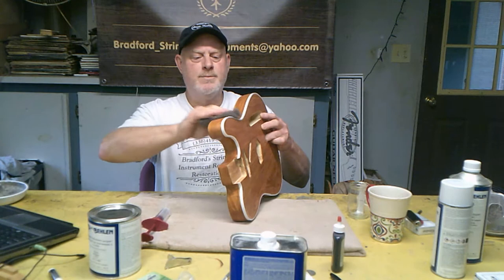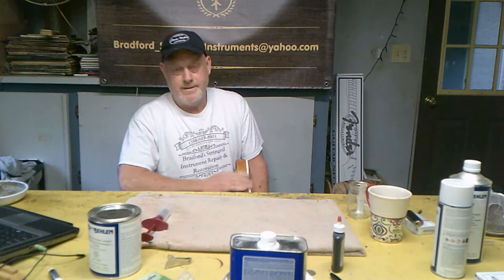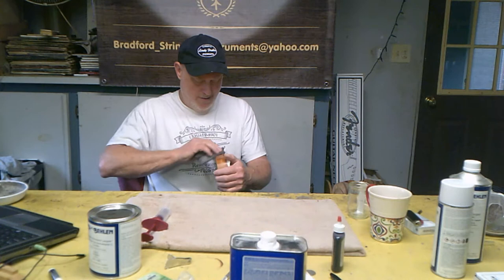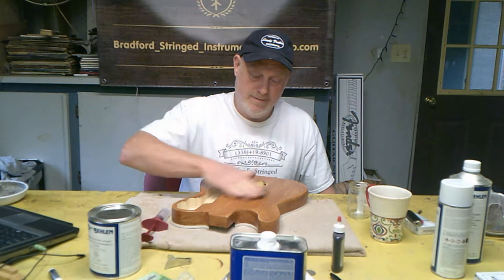All this is going to do — I like to use steel wool for this because if there's any trash in the sealer, it has a tendency to snag it rather than sand through it. It'll snag it and pull it out. In my mind, at least, you definitely don't want to sand all the sealer back off. Two or three coats of it is just wasteful and unneeded — it is not going to work. You're going to have to have that coat of sealer on it. Kind of think of it as a barrier that has to be in place, and if you sand through it, well then it's not in place anymore.